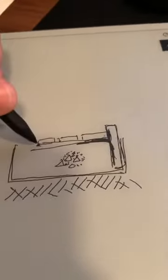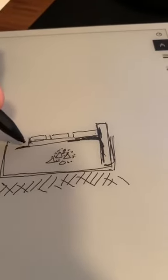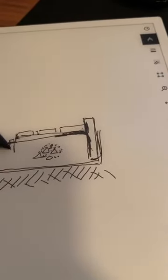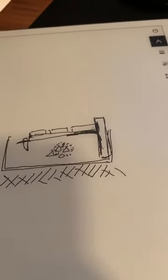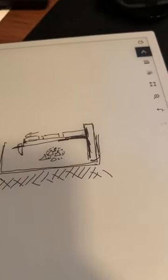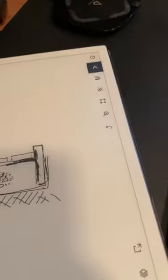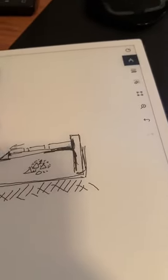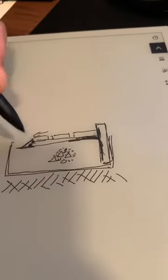On the other side here, if I was putting in an edge restraint, I would want to encapsulate my bedding and encapsulate my pavers. And like we saw, there's that Pave Tool hybrid edging with that V-shaped spike that would be driven in to anchor the edging to the base. And that would prevent the pavers from moving here. Alternatively, I can use a reinforced concrete product like Extreme Edge from Alliance, which I would trowel in on a 45, and that would be reinforced. So that's what this little symbol here is.